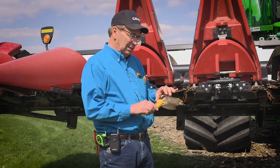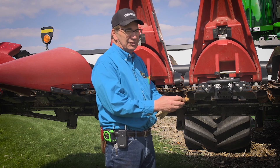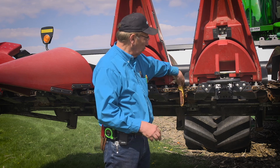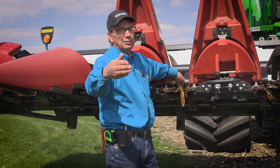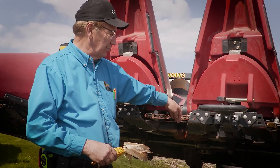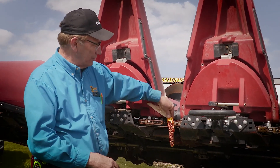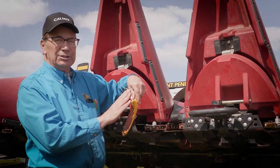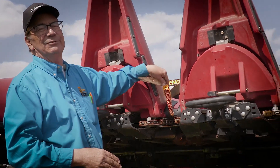In down corn you're going to get situations where the ear comes in, takes some kernels off, and then the ear will want to wedge into the row unit and just stop — all the stalks start piling up in front of it. People often ask why the bottom of the stripper plate gap is tighter than at the top. If we're inch and three-eighths down here and inch and a half at the top, that's because when the ear wedges into the row unit and we apply energy to it, that stripping gap keeps getting wider and wider, so it's easy to get it to flow on up.